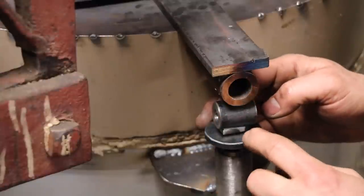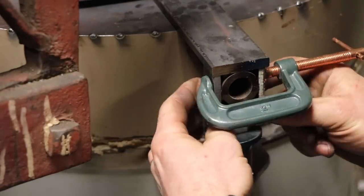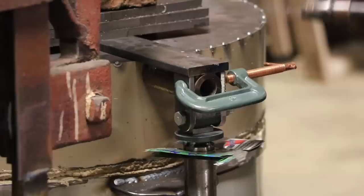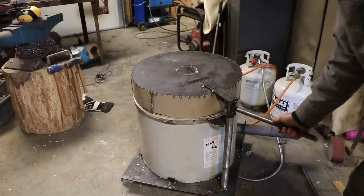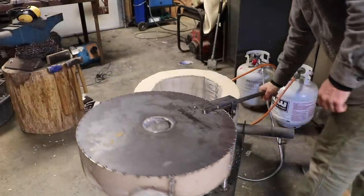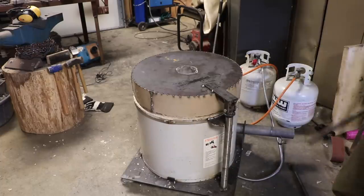This is going to be welded onto the piece that will rotate. I'm going to put some healthy tack welds on everything. Before I totally weld it up, I'm going to test it and make sure it works. Let's give this a test run — handle goes in, picks the lid up nicely. I just need a hook here that I can hook under so I can let go. The hinge works well, so I'm going to go ahead and weld it up.